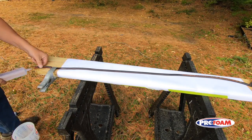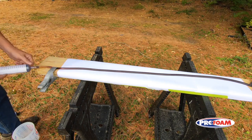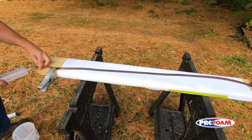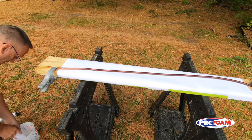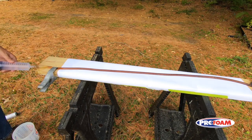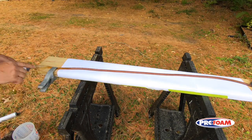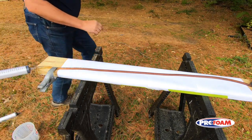So let's push another 150 milliliters through there and see how that does. I can just see it's starting to get a little bit lighter here. Let's go with some more. See, it's starting to lighten up a little bit, but it's going to take a long time for that chemical to come out because the chemical is clinging to the walls of that hose and does not want to purge cleanly.